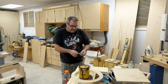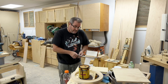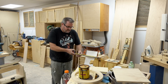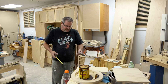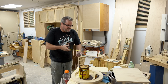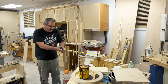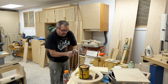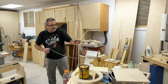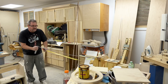What I need to do now is stretch out this coil to around about 65 inches long. Right now it is 15 inches, so I figure the best way to do this — I've never done this before — is to clamp the lead wire in the vise here and just pull back from the other end until I hit 65. I'll just concentrate on the stretching. It looks right, it looks even.